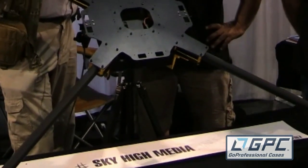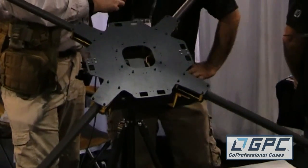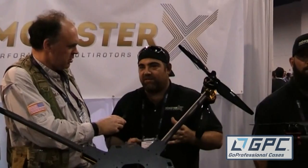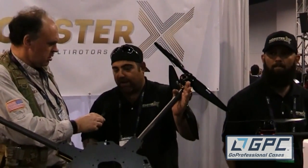What does modulus mean when it comes to carbon fiber? Modulus is the factor of stiffness. You have strength factors, which means you can twist it and pull it any way you want and it won't break. But then you have modulus, which is stiffness — so no matter how hard you push on it, it just doesn't bend.